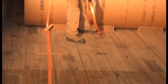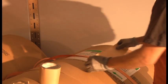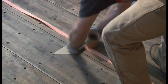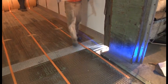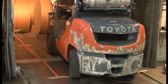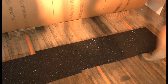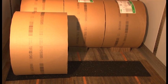Roughly check the strapping length before you begin by estimating where the final rows will be placed. You can also measure the strapping in place using this same method if you do not know what length you will need. Place your wedges to the right or left of the center line of the roll so they will not be positioned under the strapping. Then place straps so they are aligned to the center of the rolls. Center alignment is especially important on the two outside rolls. Use tape to hold the strapping in place. Make sure there are no kinks or twists in the strapping and ensure it is well taped so it will remain in place when you drive over it to place the final rolls. Just before laying down the last row of rolls, place rubber mats where the rolls will contact the floor. This will ensure that the last tier doesn't slide from side to side.